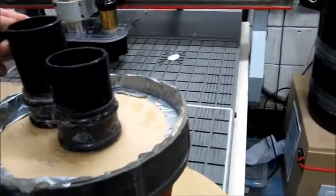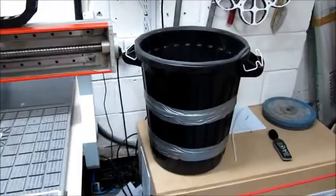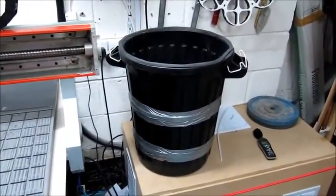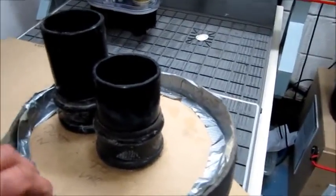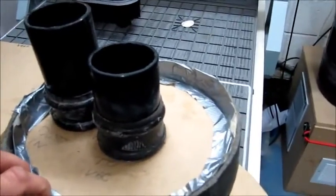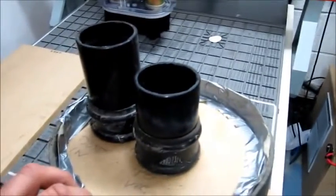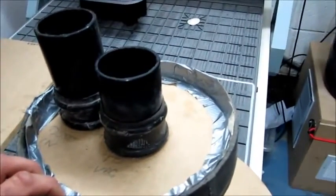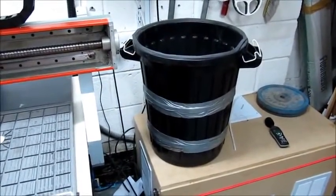the cone, and it should be increasing speed as it gets to the narrower point, and then as it hits the plastic bowl it's trying to spin around the outside of the dustbin, and hopefully most of it drops to the bottom, which it actually does. Some of the fine dust does get through, but that's what you're expecting. I've tried it with tissue paper when I'm vacuuming off the workshop floor. It does suck up anything there, and most of the debris is ending up in the dustbin. And the dustbin's obviously relatively easy to empty, and there's a lot more capacity in the dustbin.